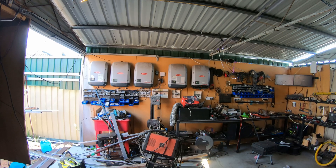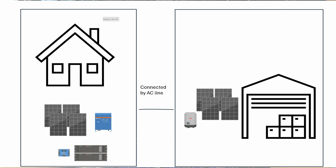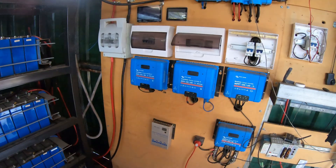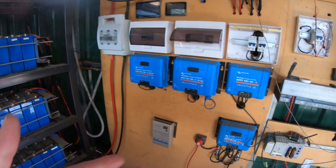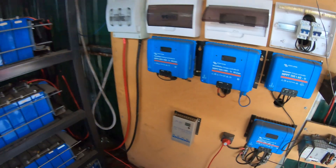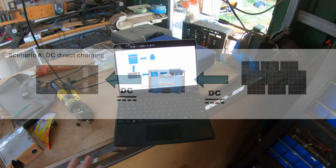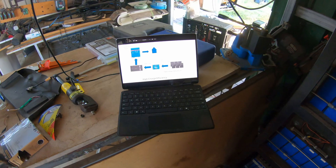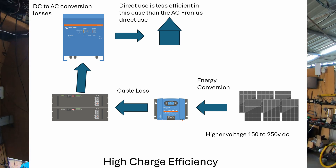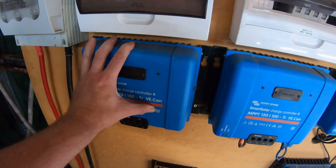It's about the microgrid, not necessarily the DIY community — servicing houses over geographically separated locations is where AC coupled shines. They don't have to be installed next to the battery; they can be at a distance, provided voltage drop over the AC cables isn't significant. You might have batteries at your house and a PV inverter on your shed 100 meters away — that's fine because it can back-feed into the grid. Generally you don't see AC coupled in DIY solar because you put your charge mechanisms with your batteries. The MPPT itself has a high energy conversion rate, which is great for charging, but the battery inverter isn't quite as efficient as the PV inverters.